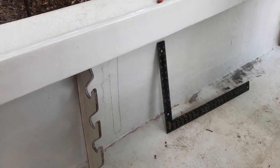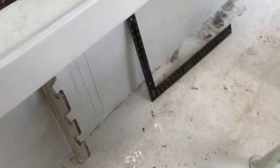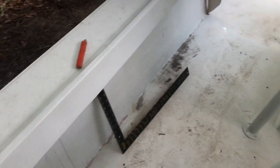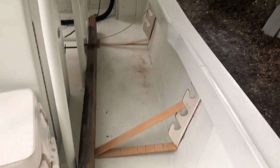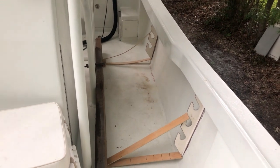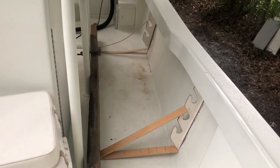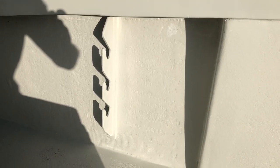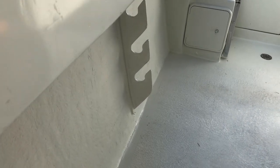There are lots of showers today so I won't be able to glue, but I do have the little holders laid out where I want to put them so I can grind the paint and clean that up, then figure out some bracing to hold them up against the wall while the glue dries. I got some adequate holder-uppers — it's going to rain hard so I'm not going to glue them today or they'd fall off. Rod holders are now epoxied to the hull, caulked around the perimeter with marine sealant, painted, and they look pretty good. Still need bungees to keep things from jumping off.